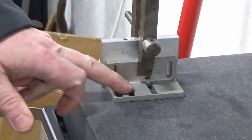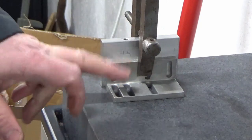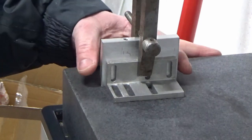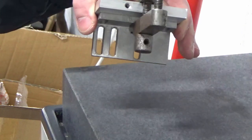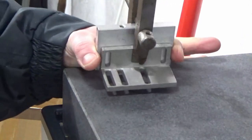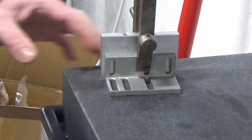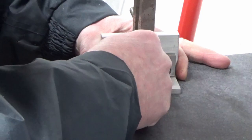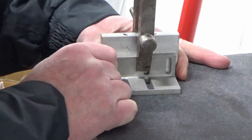So we've got the horrible nasty bracket that came with the DRO. I'm going to use this for the Z axis — that's probably the only one I'm going to use. I'm going to use it to clamp one of these bits of aluminium that I've just put two threaded holes into. You can see those there. These slots aren't accurate, they're just cast, so I'm just going to scribe where those slots are and basically pick these up on the mill or I might even just do it on the pillar drill, just to put two tapped holes into the aluminium plate.